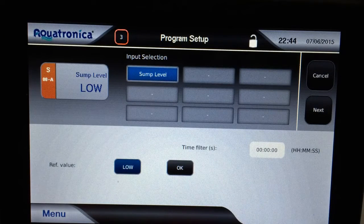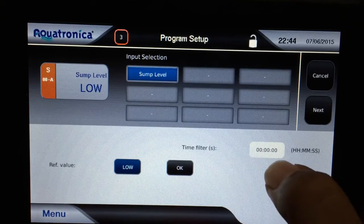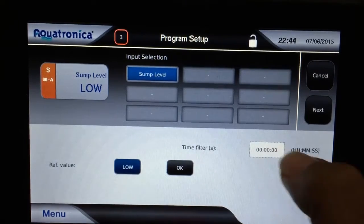When I get a low sump level, basically within 3 to 4 seconds it's typically up, and I then have it send water for another additional probably 10 seconds so that the solenoid is not switching on and off too often. But since I know within 3 to 4 seconds it'll typically correct itself, I want to set that the alarm doesn't come on unless more than that length of time has passed.